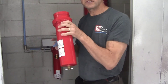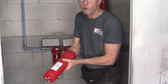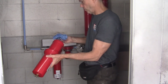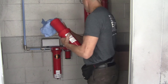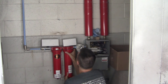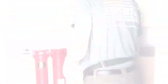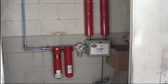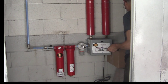This one for the coalescing filter has got the petcock in the bottom. That goes in the second position with the coalescing filter on the PERF 25 or PERF 50. The PERF system will reduce compressed air humidity below 1% on a continuous basis and reduce dry time by 70% compared to a refrigerated dryer at 15% compressed air humidity. Always wipe your filters down so they look nice.